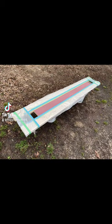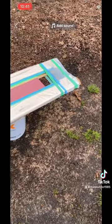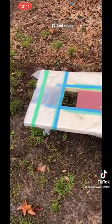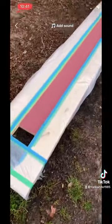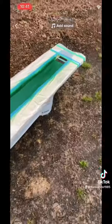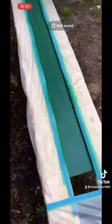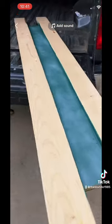How did I go from this to this? I'll tell you what, it's a process. The process takes two 2x6s and a 1x6. You sandwich the 1x6 in between the 2x6s. Then you get a piece of plywood, rip it and screw it on underneath — so you can't see the plywood of course — which will give you a little bit of a valley in the middle.